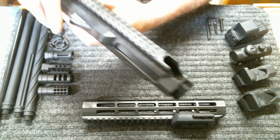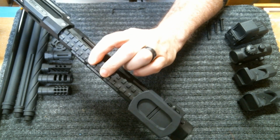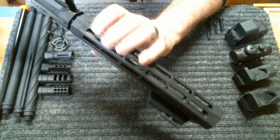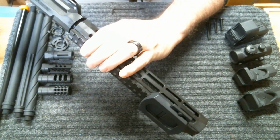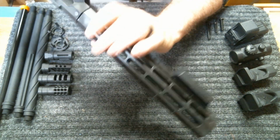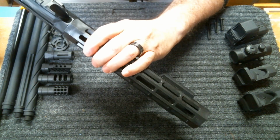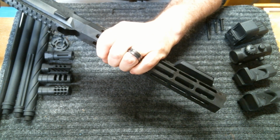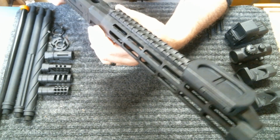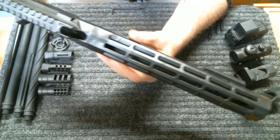Finally, you're going to screw on the handguard, and that obviously just screws in place. What I don't have on this upper here is there will be an O-ring right here. That'll help tighten this up when you get close so that you can properly key the handguard to the rifle. So what you don't want is it to rotate while you're playing. So that lock O-ring will lock it into place once you have it locked down. Not pictured here, but there'll be an O-ring on there.